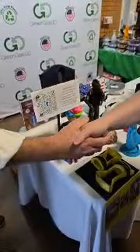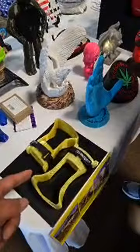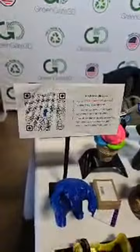So, what do you guys have going on around here? We have the best PETG on the planet. Obviously, if I can do that with a goat, we can do that. The layer lines on these things are really tight. We run a 0.4 nozzle at 0.2 layer height, so it really gives you great layer adhesion. Love that. It has all the strength you need. It's all made from recycled plastics. Even better. All made in the United States.